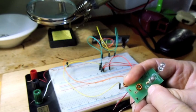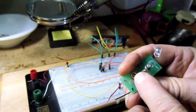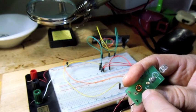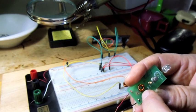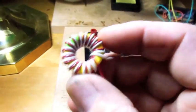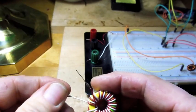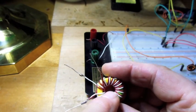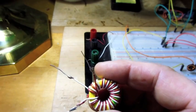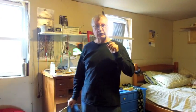Your resistor can't go in wrong. And your coil — we've gone over it — but if it doesn't light, you've most likely wired your coil incorrectly. The issue is not having opposing ends twisted together. The way this coil is wound, the two windings are going in different directions on the toroid, so when you power them up the magnetic fields can oppose each other and eventually shut each other off. That's basically all there is.